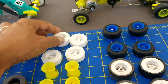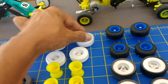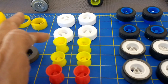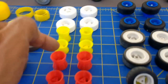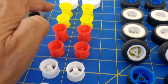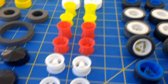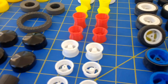In this row we have the fully integrated hub and tire in PLA - not rubbery, just PLA - meant to be used with rubbery sleeves over that. These are actual hubs for a racing wheel. These taller ones take a fatter wheel at the rear, and these are for the fronts. Some have a slight cone to them and some are straight, which provides different types of grip on the tire and allows use with different tire materials.